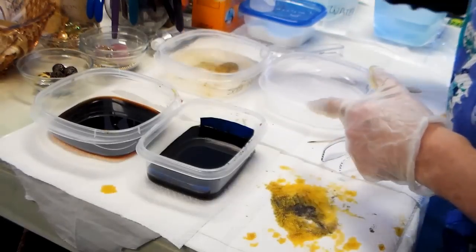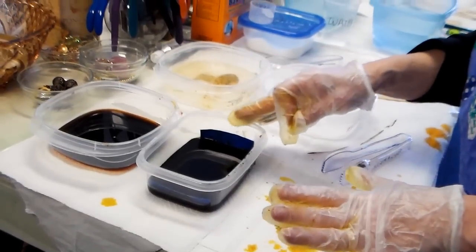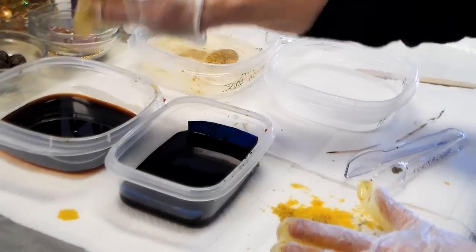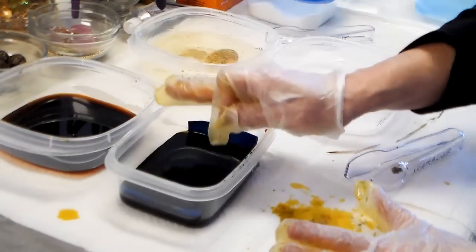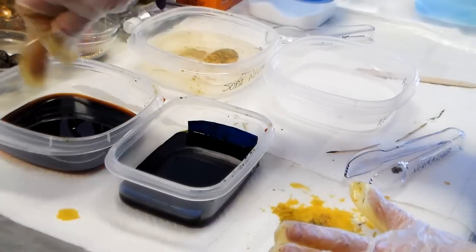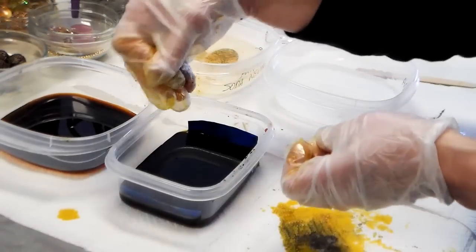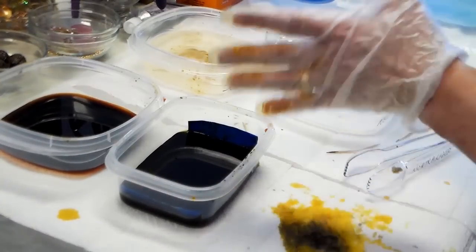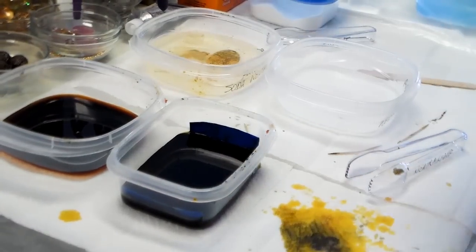Now, you put several pieces in here. I do want to make a point here. If you are etching with copper and brass, you etch your copper always separate from your brass or any other metals. You don't mix them because they interact with each other in the etching in a not positive way. But we're only doing brass today, but I did want to mention that in case you want to continue on.